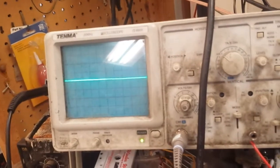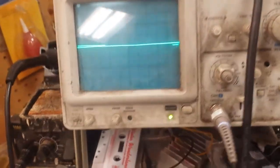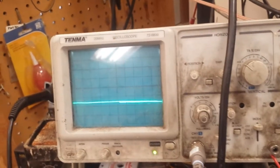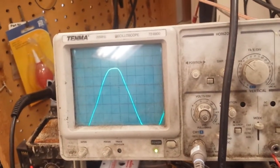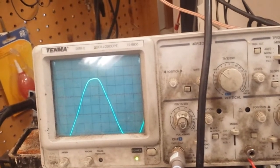Let me center this so you can see it better. It's a very clean-looking waveform — the top and bottom is nice and rounded. It's not flat and distorted like it was when it was coming in. So that gives it a cleaner signal and helps it synchronize.